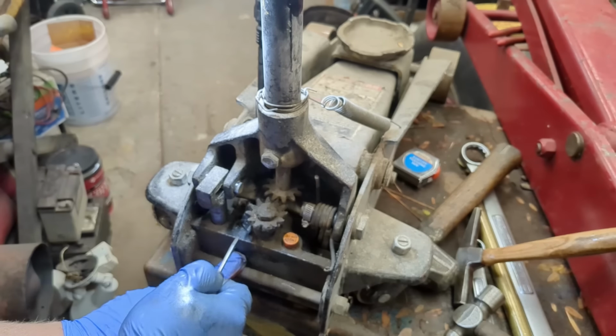That just drains the fluid back into the reservoir right down here. This hole right here is just your fluid intake from the reservoir to the main piston. And there's your oil drain right there. The question is, do you replace the check balls? Look at them. If it is pitted, if water sat in there, sometimes they'll get pits on them. Yes, replace it. But otherwise, do nothing.